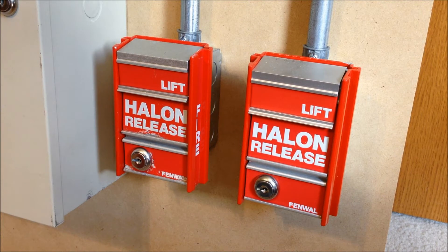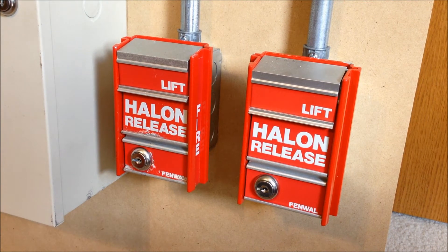By activating one of the manual pull stations, the system is going to skip all of the pre-discharge and general alarm stages and go straight into agent release mode. In this mode the notification appliances will be on continuous — both horns will be activated, both strobes will be activated, and we'll see the releasing agent message on the panel's LCD. Let's go ahead and get started.